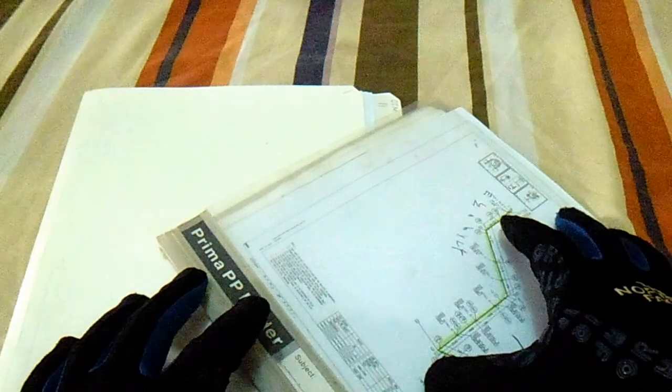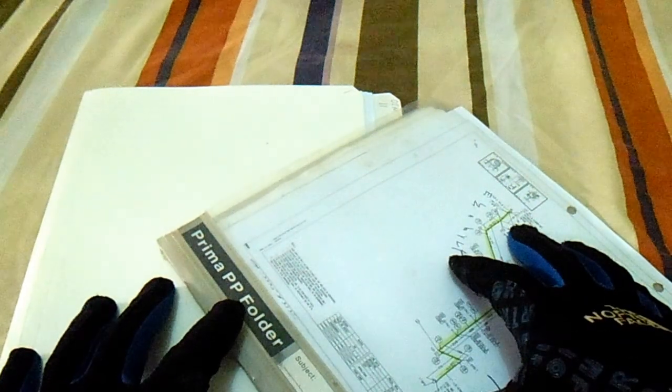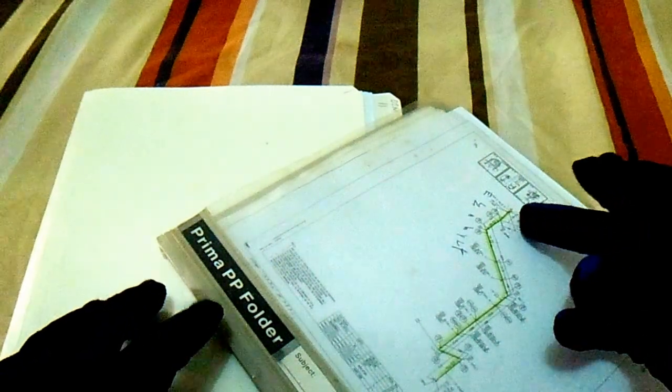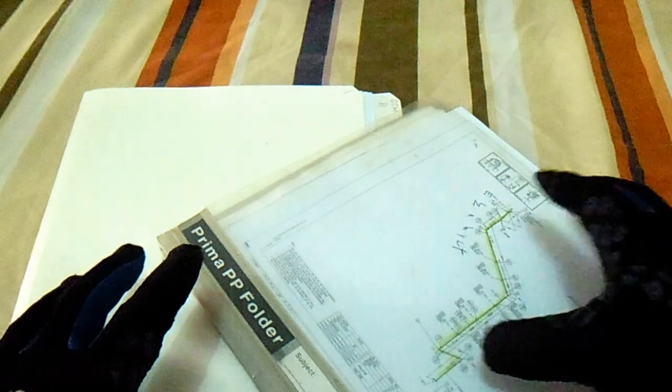Also, all punch list categories must be cleared and signed by the contractor and signed by the company. And also, all documents here must be clear — like the isometric, which must be the new revision and have a highlighted line and also a test limit. This is important.